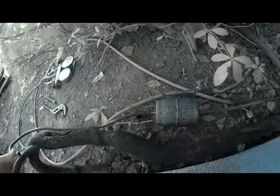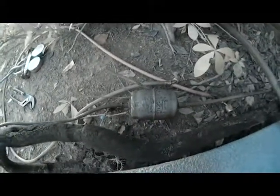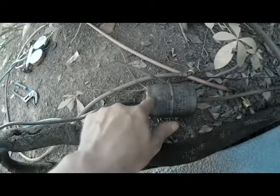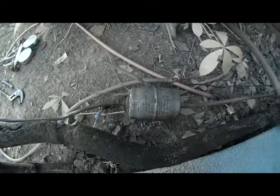Basically, the freon runs from our condenser, into our filter dryer, and back up to our evaporator. This really protects your metering devices — so if you have a piston or a TXV and there's any contaminants, or little pieces from where you weld, this right here will protect your metering device and keep any dirt from getting into it. That's pretty much what your filter dryer is for.